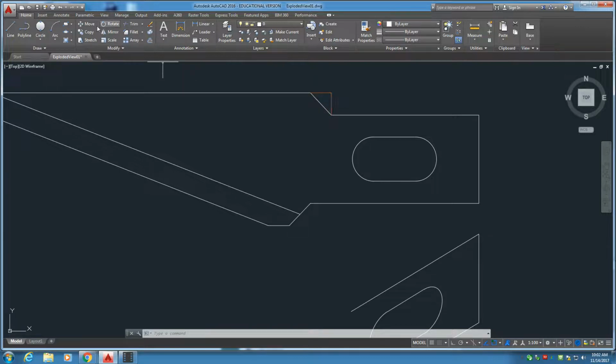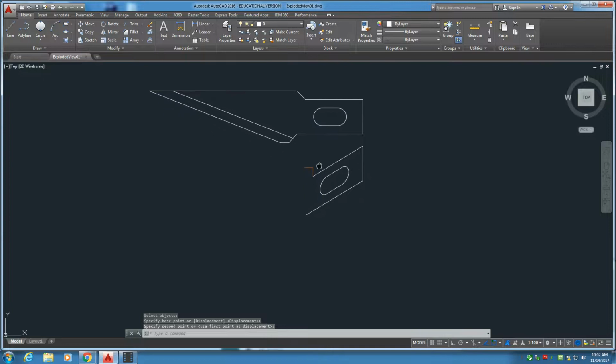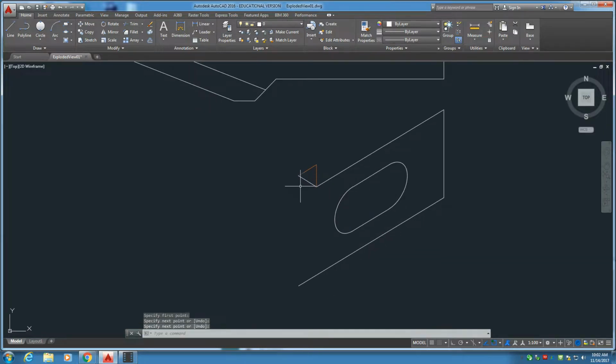All right, here's what I'm talking about. Let's go ahead and move this quote-unquote bracket from this point to here because that's where it appears. You see? It was there, now it's here where the line ends. Go ahead and rotate this line 30, and this line remains the same. Why? Because it is a vertical. Horizontals get rotated, not verticals. However, if I connect the two dots from here to here, you'll see that the new angle is now calculated for us. So the bracket system is what's going to give us the proper angle on here.